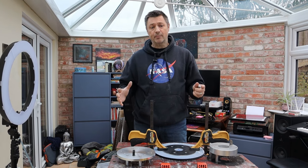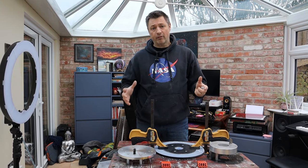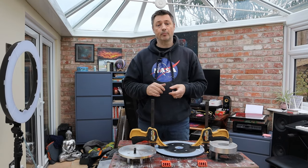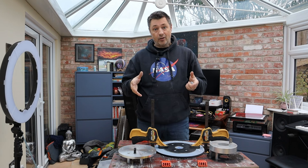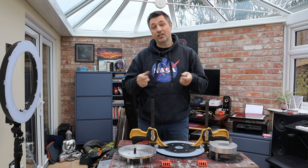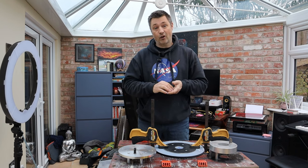I've dug some nice big holes. They've got some rebar in the bottom and gravel, and they're all going to be cemented later this week, then cementing the tube. I need these pier adapters at the top ready before I put the cement in, because I need to set these into the wet cement so that it goes off and holds them firmly in place.